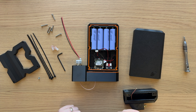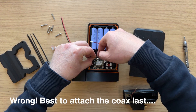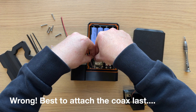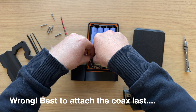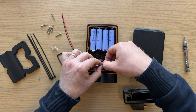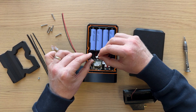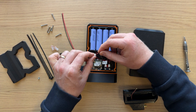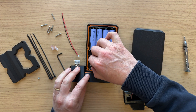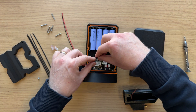Now we want to connect our antennas up. We have the coax from the N-type on this one — it's basically exactly the same. If you order the SMA, the cable's a little shorter. We want to connect our cable and then the Bluetooth antenna. Then you can take your power connector — note the polarity should look like this, the red going to the red dot on the rack board. Our switch is in the off position, so there's no danger of it turning on.